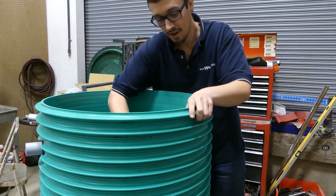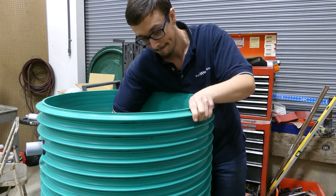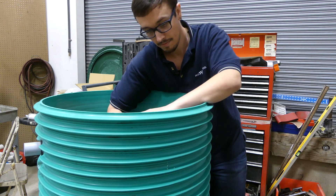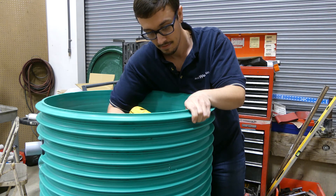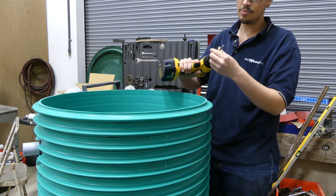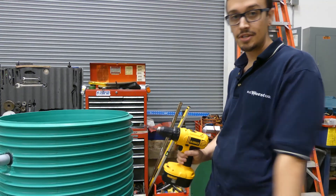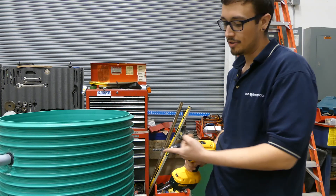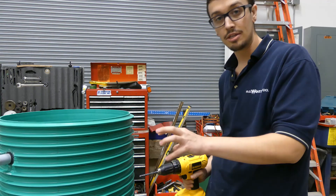As a reminder, we've got our quarter-inch drill bit to put in these pilot holes. Then for step two, we're going to use our 5/16th drill bit and ream out the top hole just a little bit larger so it can accommodate the bolt that secures the splice box to the riser.